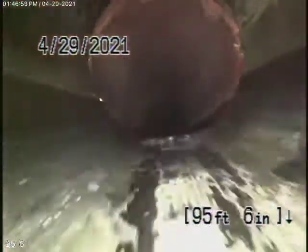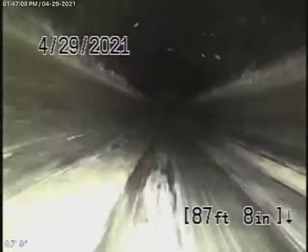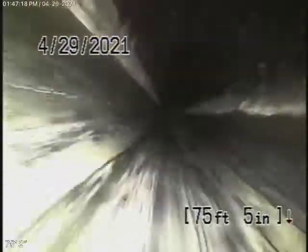It comes back to a short section of 6-inch clay pipe. The sewer goes into the easement and comes back to a 4-inch clay pipe. Then we've got some ABS plastic over here. This has probably all been replaced over here, and it all looks pretty good so far.